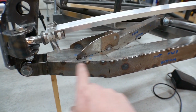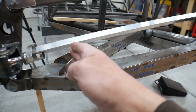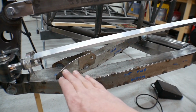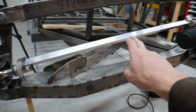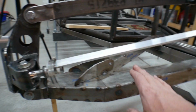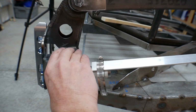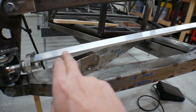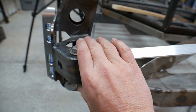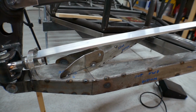But in the next video, I'm going to reinstall that lower control arm, and then I'm going to make some blocks using that lower control arm as kind of like a flat surface, and I'm going to use that to figure out what angle this needs to be at to be perfectly flat with that. And if I do decide to make that change, I'll take this off. I'll grind out this whole piece right here. I'll set this up in the perfect position, and then I'll fabricate a new bracket that will bolt onto that exactly where it needs to be so that this is parallel with the lower control arm.